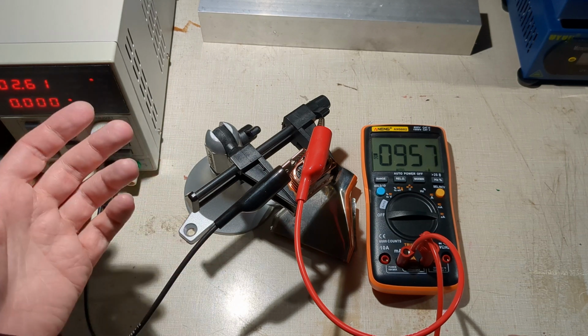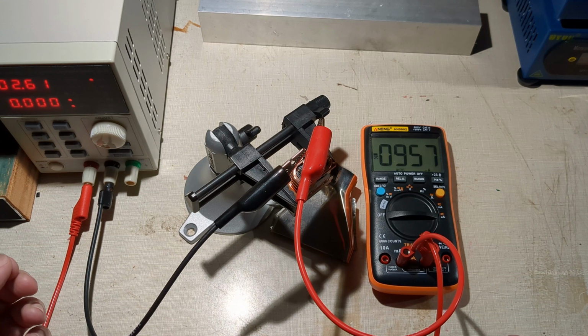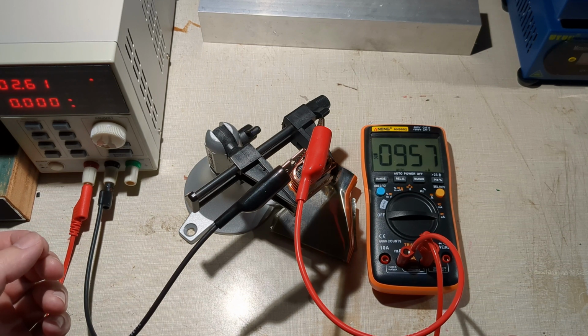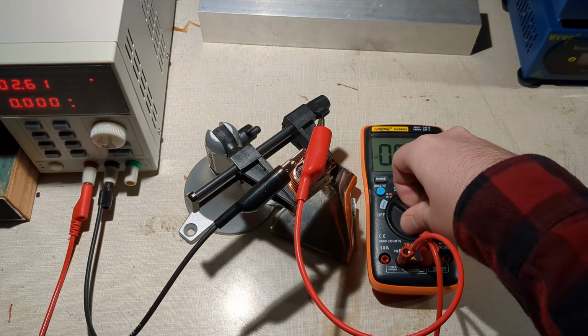If you're using turbo mode, for example, you may want to check how it performs, because I've noticed on other lights where if you use turbo, there's a high drain and it doesn't always cut off correctly. It skips past the cutoff and it keeps going down, which can be bad for the cell if it goes to 0. Cool, thank you.